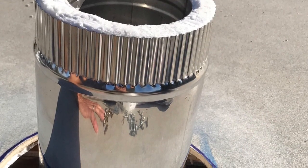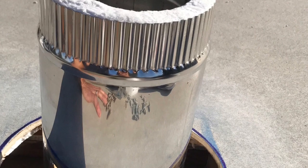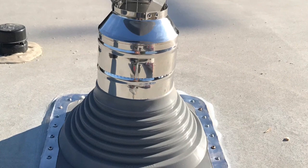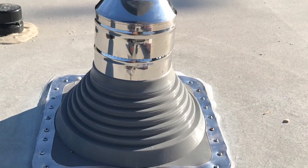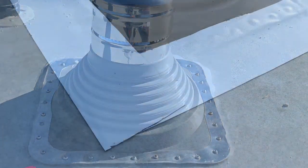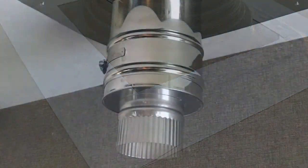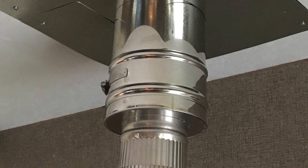Here's a picture of the stainless steel double-walled pipe used to exit through the ceiling of the RV — the overall pipe is 6 inches in diameter. Here's a photo of the nearly complete chimney pipe installation coming out of the camper. It's a silicone boot supplied by tinywoodstove.com, with silicone caulk where the boot contacts the camper. For added insurance I added EternaBond tape around the seam where the boot contacts the camper.